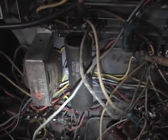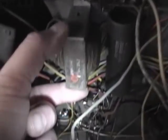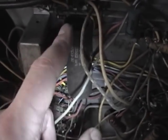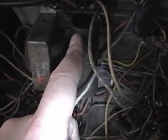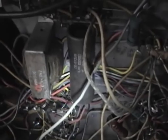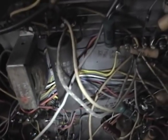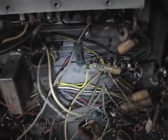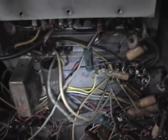The vertical is bad. A few obvious causes would be the vertical output transformer, this capacitor which is probably part of the vertical output circuit, a bad vertical output tube, or a bad vertical oscillator tube. The least likely possibility is a problem with the yoke — the vertical yoke windings could have a shorted turn in them. My gut tells me it's this capacitor.